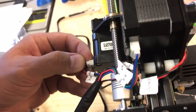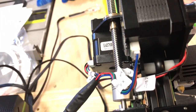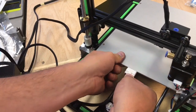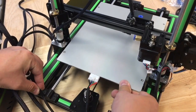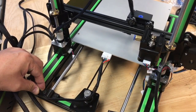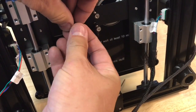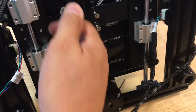After I got it all assembled, it wasn't until I tried to home it that I found out the extruder and x-axis were mislabeled — they had the wiring backwards, so I had to reverse those. Then I installed the connector for the heated bed, which was actually a nice connector, but the problem is they put it right in the center of the heated bed. So if you strap it to the back, when the bed goes forward the wiring hits the motor. I had to reroute it underneath the bed, around the bracket, and tie-strap it there. Why they didn't offset that connector I have no idea, but this is the wiring you never want to short.